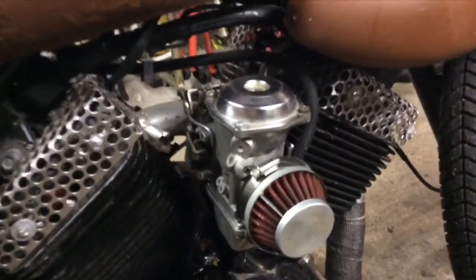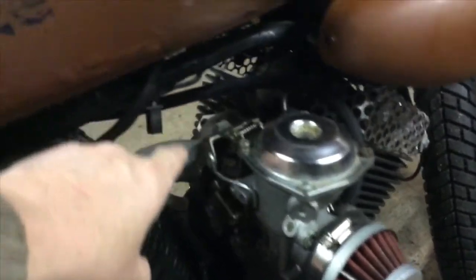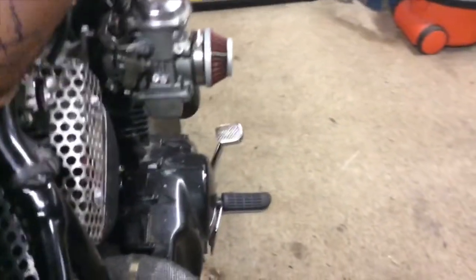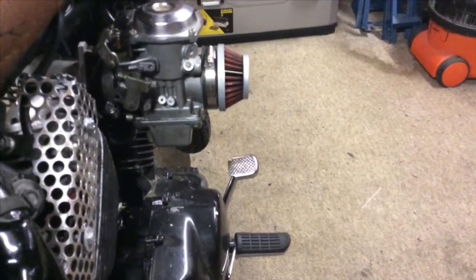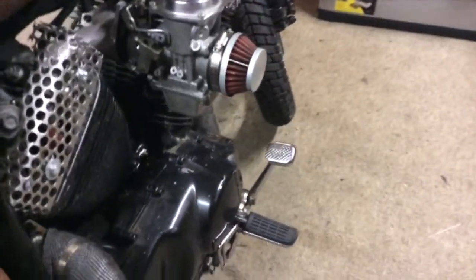as you can see, I've made some modifications to the carburetor, as in where there used to be two undertank twin Mikuni carbs. I had this 2-into-1 manifold made and stuck a Hitachi carb on the side. And the problem is that it fouls on my leg when my foot's on the foot peg, and I have to awkwardly move my foot across to the brake pedal.